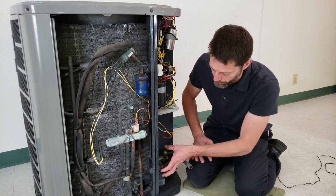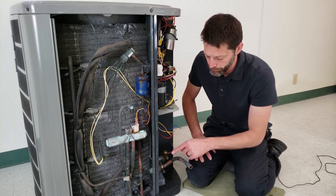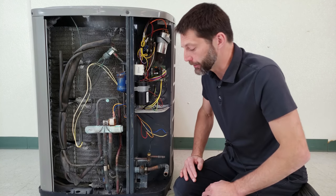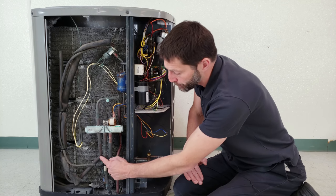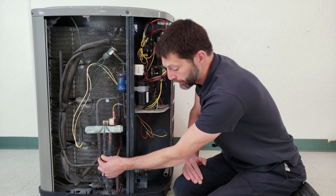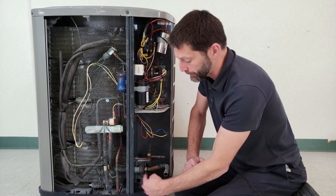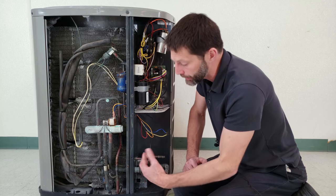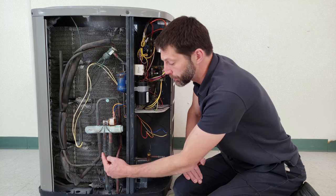So that's why I wanted to cover both of these. These two right here have valve cores in them once you remove the port caps. Now if you were to add refrigerant into this system while in air conditioning mode, you can add it at this port or at this port because this is the true suction port. If you're in heating mode, these are both going to be high pressure. Remember that this is your discharge line and this has subcooled liquid refrigerant in it, so this port right here is going to be the only one that's low pressure where you would add your refrigerant.